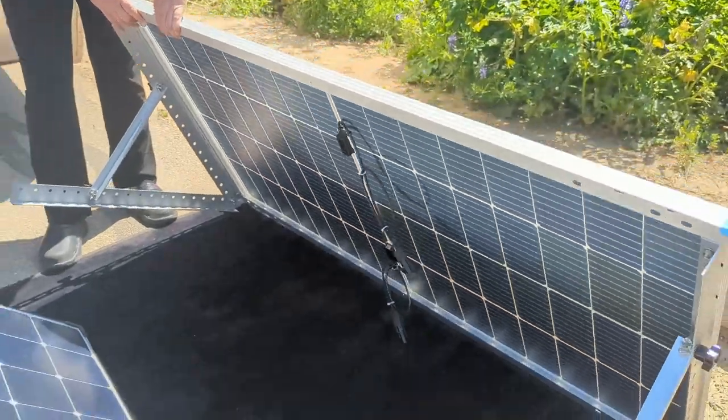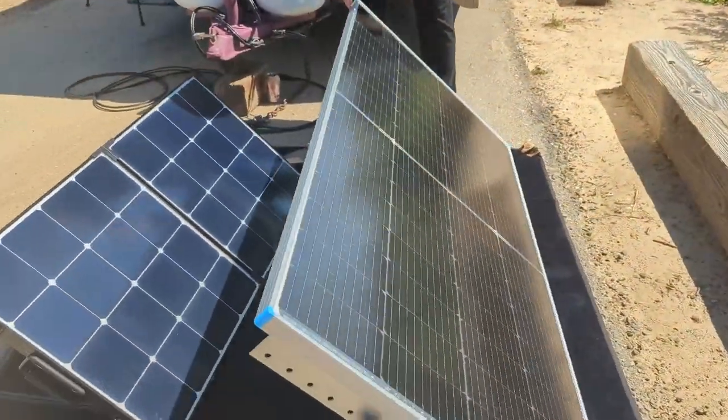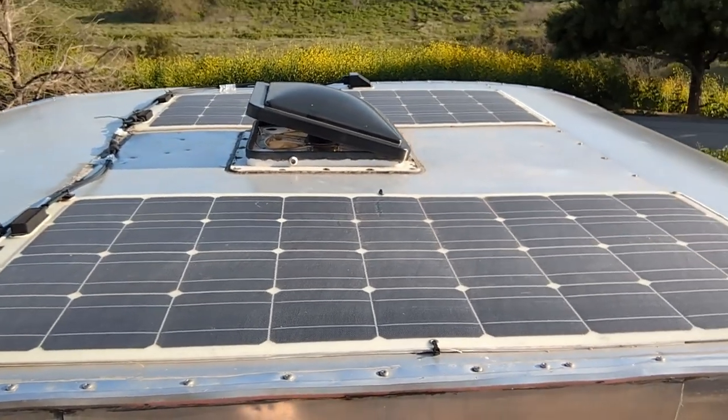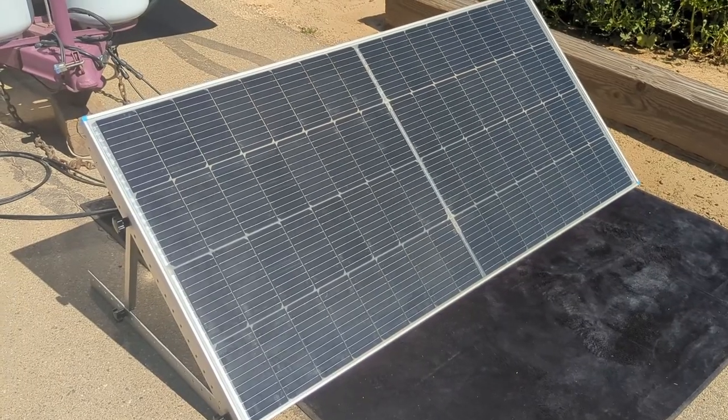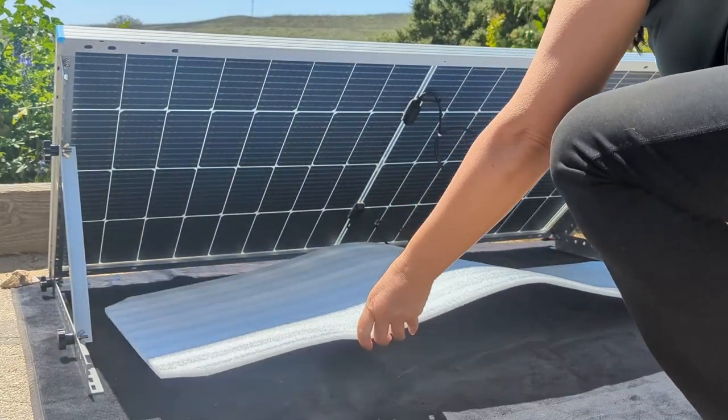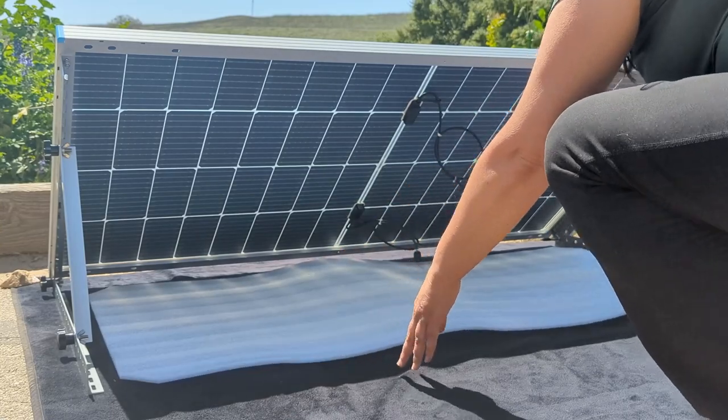Renogy claims that it is up to 30% more efficient with this new design. It is an absolutely beautiful day, not a cloud in the sky, it's about midday, so it's a perfect time to test this out. We have disconnected the panels from the top of Hamlet so that we are charging just with this 220 watt bi-facial panel. We're going to test it on a black surface as well as a white surface to try to replicate what most RVs have on the roof.